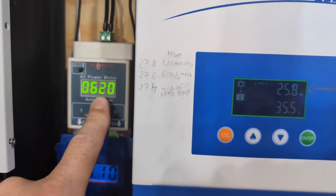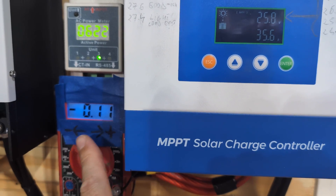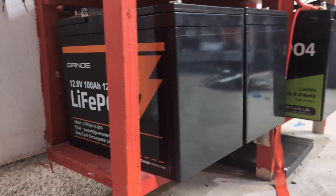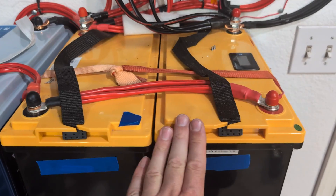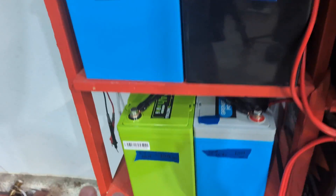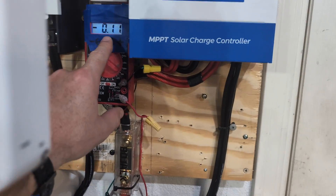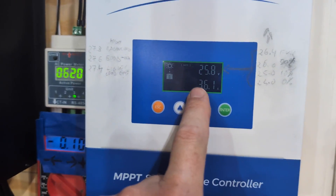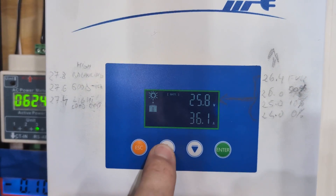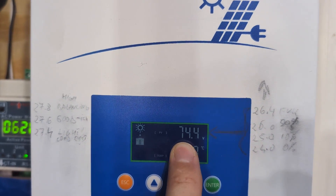My house usage is 620 watts right now. This little balancer tells me I'm pushing power to the left side of the batteries. These batteries are 24 volt - a 12 volt and a 12 volt hooked together - so there's a left and a right. Right now it's a little unbalanced, pushing 0.1 amps that way. I'm running at 25.8 volts and my entire solar system is running at 74-75 volts.